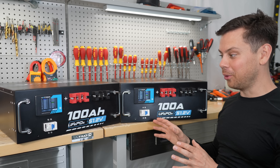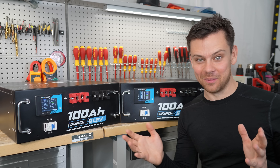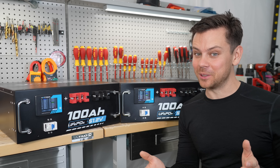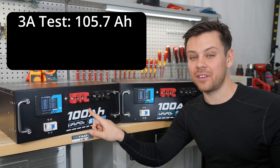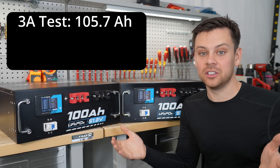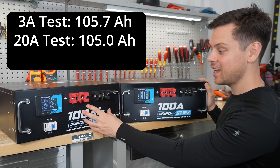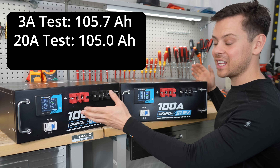The capacity test results I got for both of these were incredible and consistent. I had four Eco-Worthy batteries and all my results were completely different. And in the latest EG4 server rack battery, I can't even pull the advertised capacity — and I'm still testing that to this day. The first capacity test was this battery with a CBA5 Pro at three amps, and I got 105.7 amp hours. It took a long time, but I wanted consistency — I wanted to graph it out — and everything looked fantastic. It actually pulled more than the EG4 and the Eco-Worthy on the first try. Next test was a 0.2C rate — a five-hour rate — for both of these, and they both pulled 105 amp hours. Both were at the same temperature, the same rate, and they pulled the same capacity. Exactly.